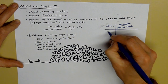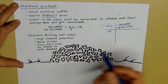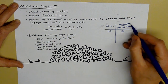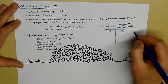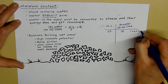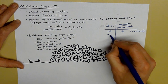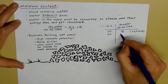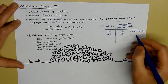If I have 20% moisture content: 20 divided by 2 is 10, plus 8 is 18. That's 18 pounds of water per 100 pounds of wood — meaning 18 pounds of that 100 pounds is water. That's about 2 gallons. If I have 40%: 40 divided by 2 is 20, plus 8, that's 28 — about 3 gallons.